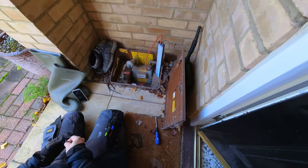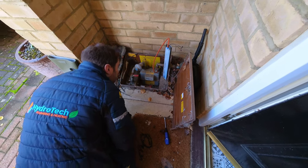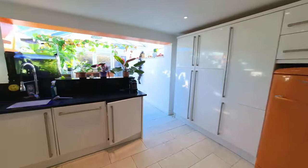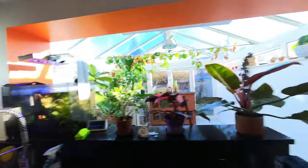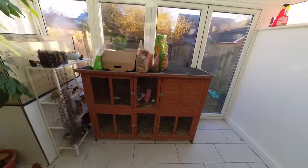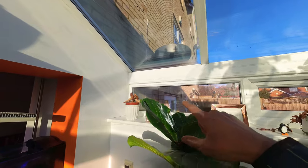Chris is going to drop — we've got a millibar drop, so it's permissible. As long as there's no smell of gas and after we've done the boiler — where's the boiler? I'm guessing in here. This looks like a boiler cupboard. Bingo. So that's going out there. Got some rabbits here as well — I'm joking. It looks like it terminates just outside there, so we've got a plume kit to put in to divert it away.